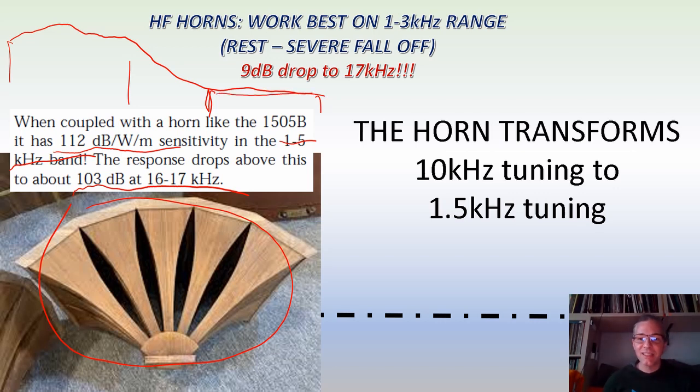So it means that tremendous efficiency, that tremendous potential and power that's in the compression driver, is really throttled back. It's choked back quite a lot. 9 dB, that's a lot. And you think, oh, then we are toast, so let's go for that beryllium tweeter. But no, you are still not right, because even with minus 9 dB down, we are still 11 dB up with resolution and sensitivity above normal tweeters.